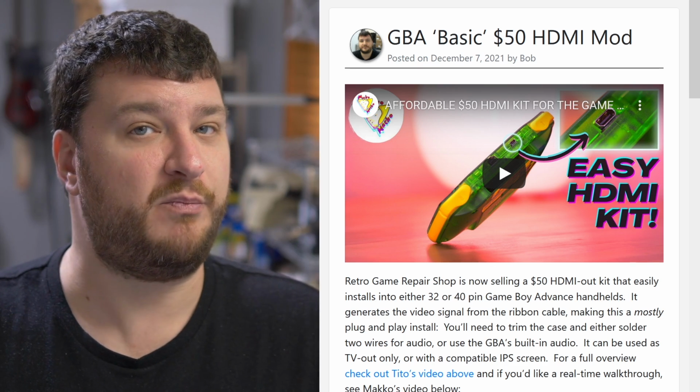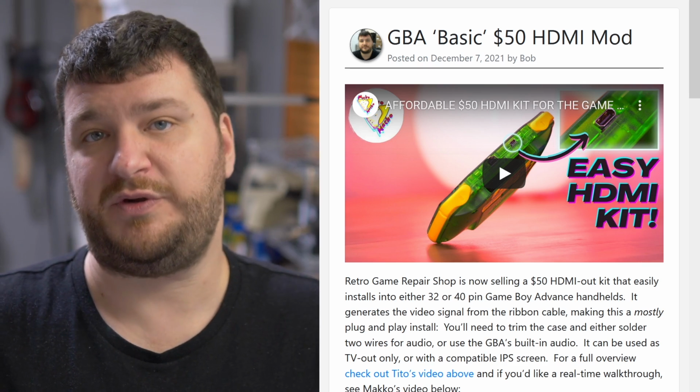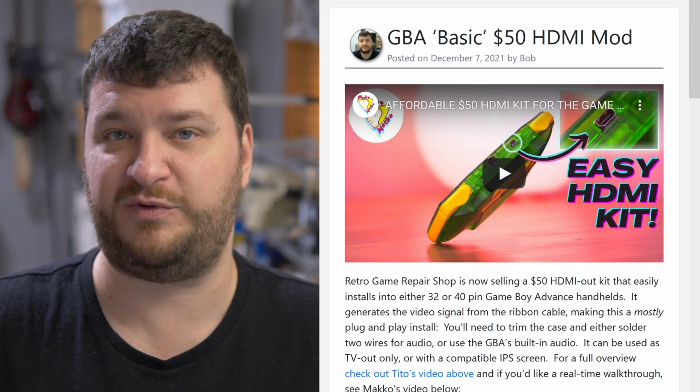But basically, this is a mostly plug-and-play kit that plugs into the ribbon cable. So you need to order the kit to match whichever motherboard revision you have, which would determine 32-pin or 40-pin ribbon cable.